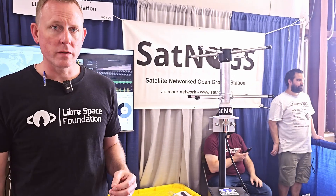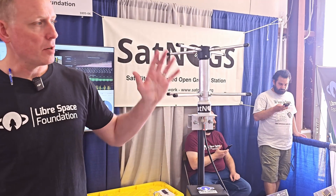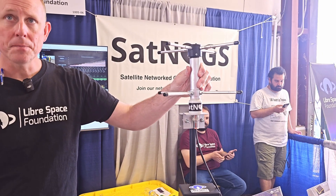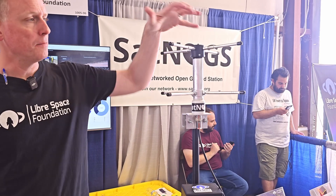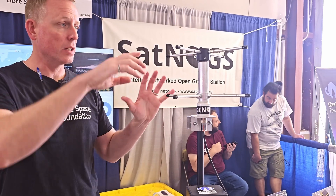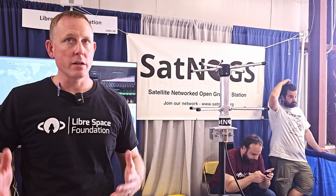This is a demo version of a beta kit we have — it's not quite ready for sale, especially in the U.S. right now. A standard setup for an omnidirectional station is the easiest way to get started. This is a turnstile antenna — these are all really easy to build by hand. Two dipoles and then a quarter-wave stub with coax gets you circular polarization. A lot of UHF band satellites transmit with linear polarized antennas, but since they may be tumbling, circular polarization means you don't get nulls just because your polarization isn't lined up.